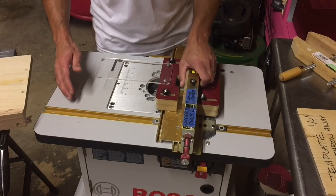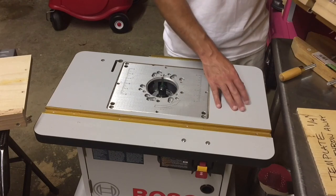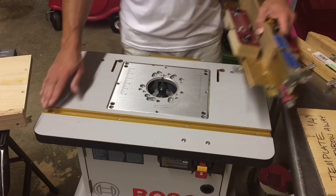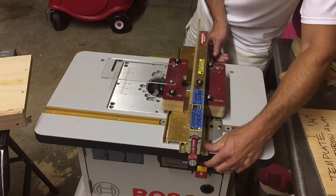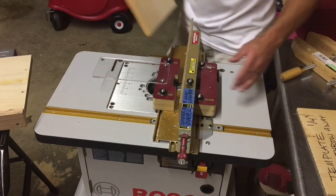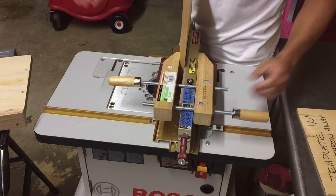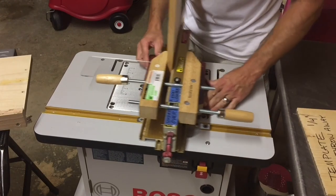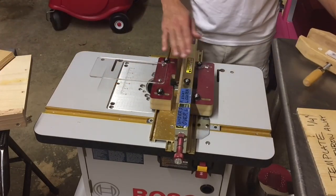To make the box joints, I've been using an Incra iBox jig on a Bosch router table. I had to take out the miter guide and put in an Incra miter guide so that it fit, and placed the extra bit over here so it slides nicely and acts as a good start and stopping point. The way these work is you take your board, fit it in, clamp it on, and pass it through. Then you bring it back, loosen it, move it over a peg, clamp it back, and pass it again. The hard part with the Incra is getting it dialed in.